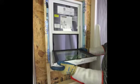Then, while maintaining that 90 degree angle, pull up on one side of the bottom rail so it frees the tilt pins from the balance shoe. Once this is achieved, lift up on the opposite end of the bottom rail to release the opposite tilt pin from the balance shoe. Place the removed sash in a safe location where it will not get broken, damaged, or lost.